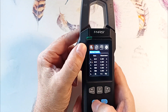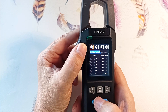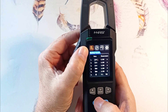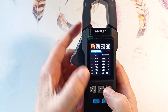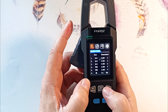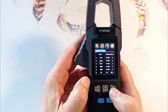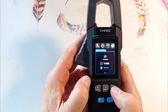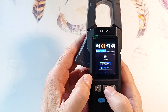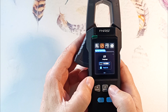On the first settings page we have remembered values — we see the last 6 values. To scroll through further, press the middle key; the page freezes and the icon turns orange. Now we can use the left and right buttons to scroll. In total, the device remembers the last 30 values. Press the key again to exit. Press the button to the right to get to the settings menu, and pressing the middle key allows us to adjust these settings.